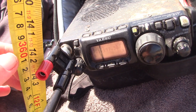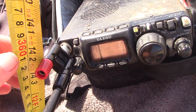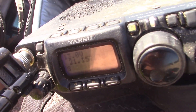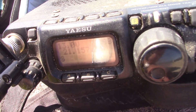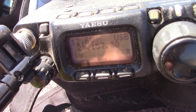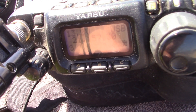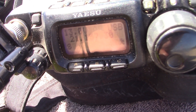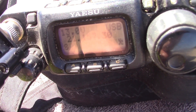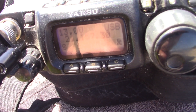Just trying it on 15 metres — it's 3.6 metres. Looking at the SWR, the FT817's indicator is only relative and it's 3 bars, so it's not quite one-to-one, but I'll see if I can make some contacts anyway.